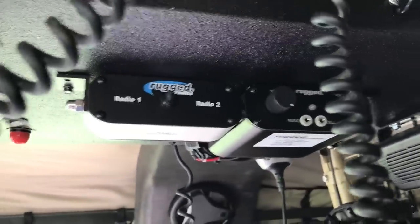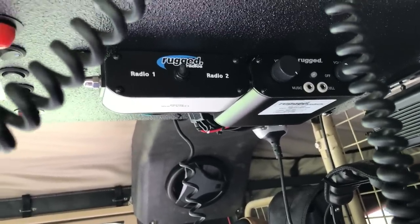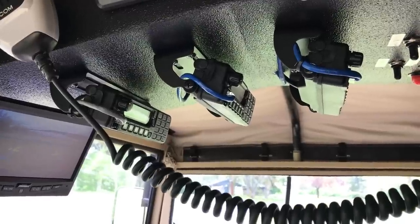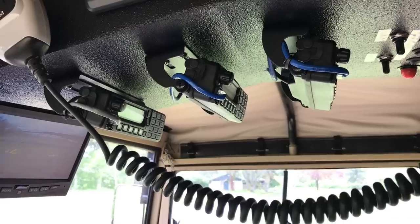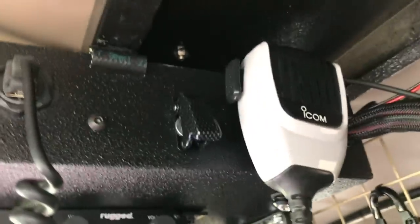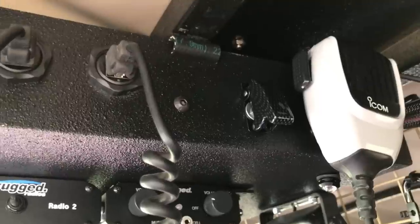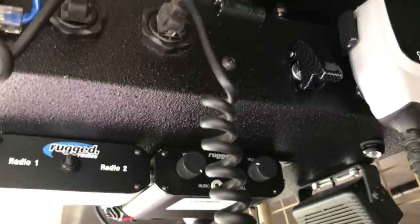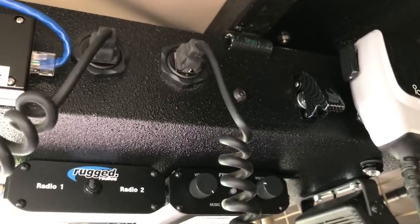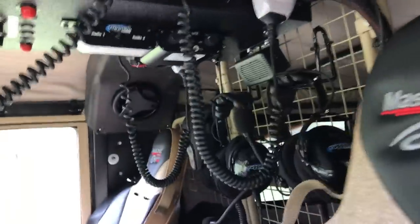I have that tied into this radio switch. What I've done is hacked the output and input of the Rugged Radio intercom system to tie it into radio one and radio two. The front two radios are VHF — I can run some ham frequencies I've got pre-programmed in, plus all the commercial frequencies we use during a mission. The back one is a UHF. I have the UHF and the back VHF connected on a switch so I can actually do cross-band from the UHF to the VHF — if I need to use a UHF handheld to broadcast over VHF, I can flip that switch, which I keep under a spy-style rocker switch cover to prevent accidental activation.